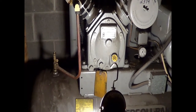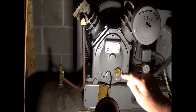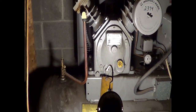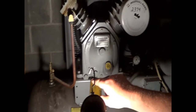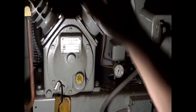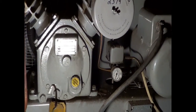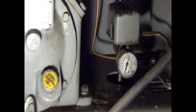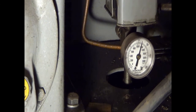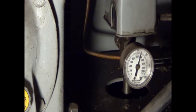Important safety tip, Gene — everybody listen to this. Do not go to change that check valve until you drain the tank down to zero. If you take that off with pressure in the tank, that check valve will come out of there like a bullet — it'll probably go through the woodwork. Right now it's only at about 160 PSI, and that's enough to ruin your day. So drain it to zero.